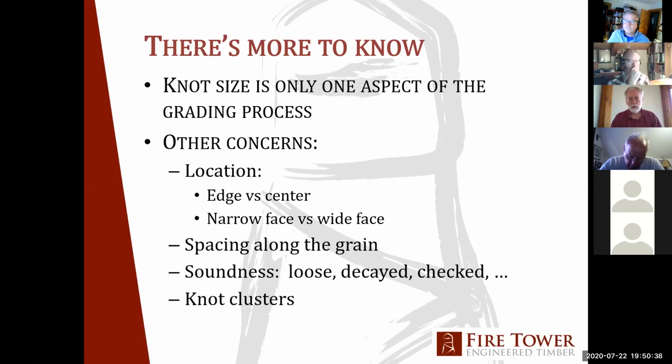When you talk about lumber, in a five-story building with 400 joists, you can start to get into some statistics because there's load sharing if the joists are relatively close together, which you don't have in a timber frame where each member is basically doing its own work. So in a timber structure, you look at the individual grade on the individual stick. You may have a dozen girders, and 11 of them are select structural, one of them is number 2. You have to determine whether you can live with that number 2.